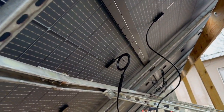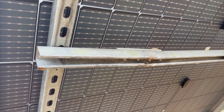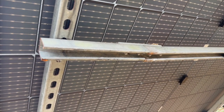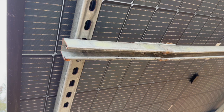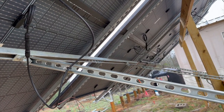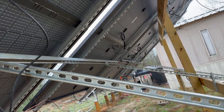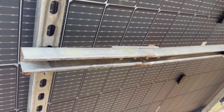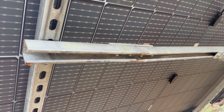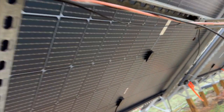The other thing I forgot — I used 10-foot unistrut, and at the end I had to splice on another 18 inches of unistrut to get the full span. If I had to go back and do this again, instead of using 10-foot unistrut I'd go to my electrical supply house and purchase 20-foot unistrut, cut it to about 11 feet, and not deal with the splice. I just didn't know the impact from the sheer weight.